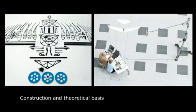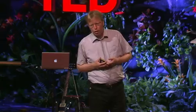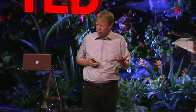We measured the aerodynamic efficiency. We had knowledge about the electromechanical efficiency, and from that we can calculate the aerodynamic efficiency. It rises from passive torsion to active torsion — from 30% up to 80%.